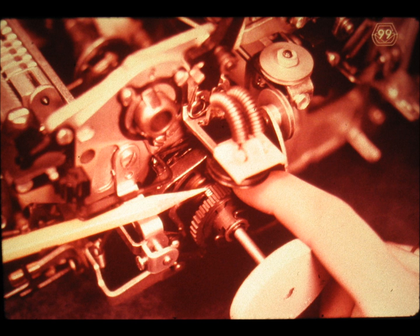When the shift cam is in its uppercase position, or capital character position, and when the ratchet is manually turned taut to the rear, the indicated clearance between the outer lug and the tip of the shift clutch latch or release arm should be at least one millimeter. You may have to make the adjustment, then reassemble the clutch and test the result a number of times before you achieve the required clearance.